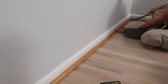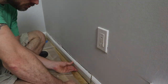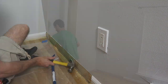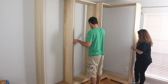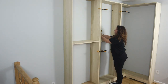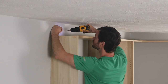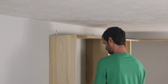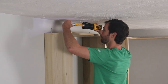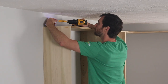For the official install, we first took out the quarter round and existing baseboards. We had cut the baseboards with an oscillating multi-tool, but we ended up ripping them all out anyway. We put the shelves in place, clamped them, and screwed them together. Then, for stability from the top, we took angle brackets and drilled them into the studs, and used a 90-degree bit to make it easier to screw into the tops of the units.